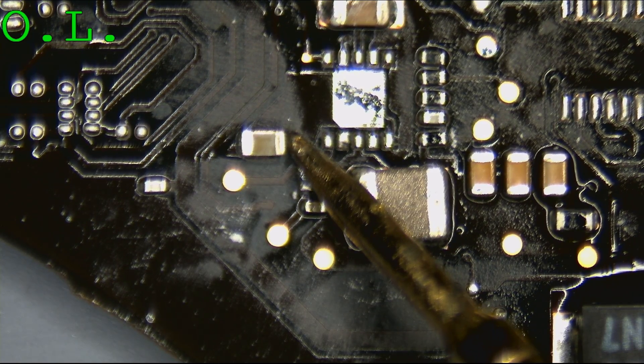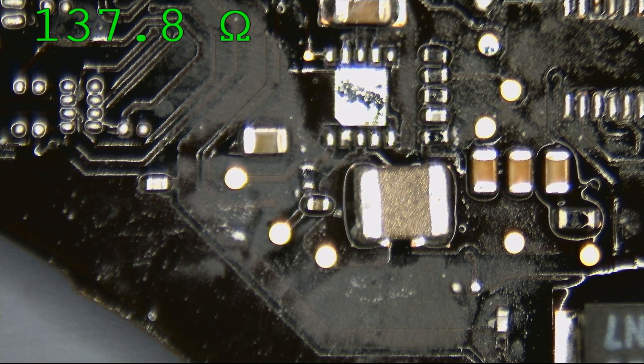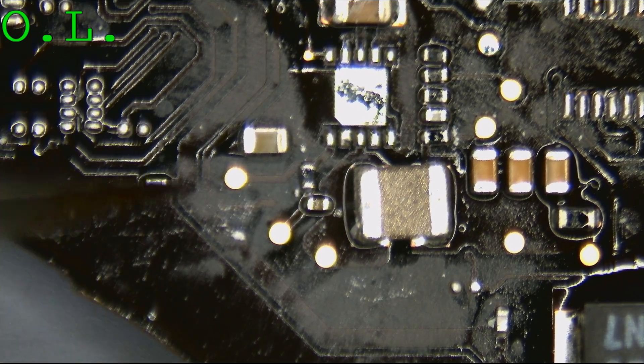Typically a chip can fail internally without any outside signs, but ceramic capacitors don't often fail internally short without outside signs. Also, a cap shorting to 164 ohms is not something I would expect — I would expect a capacitor to short to just a dead short. Let's see if my theory is correct. My theory is incorrect — we still seem to have a short. So we're just going to toss the caps off as well.